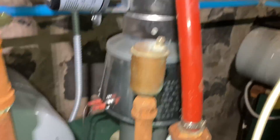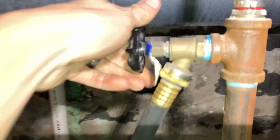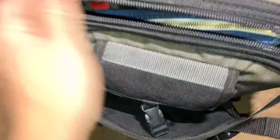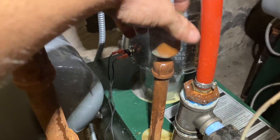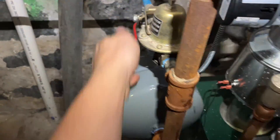We're going to stop this for a sec — I just have a feeling that this float vent is not good. So I'm going to close the feed valve, drain it up a little bit to take some pressure off, and we're going to change this on the fly really fast. This is why I always keep one on me — situations like this. Let it feed back up.